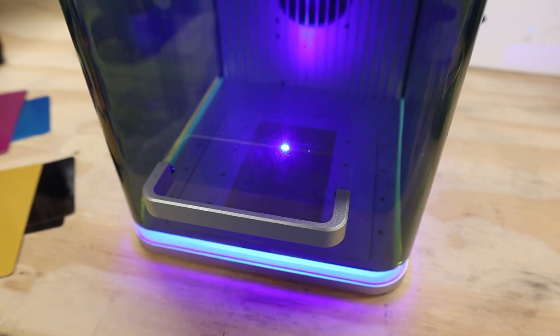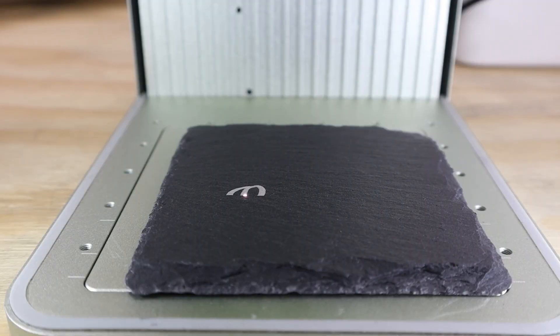In this video I'm going to be showcasing the brand new Xtool F1 dual laser machine. Dual lasers — there's two inside this one little case: a 455nm blue light diode laser and a 1064 nanometer infrared laser all in one. With a 10 watt diode built in, the F1 is capable of cutting wood, leather, and other materials while also engraving on almost every material out there. What I'm going to show you is how this machine engraves on slate, but this will apply to any machine out there — any of your diode or infrared lasers will still be able to get these quality results.